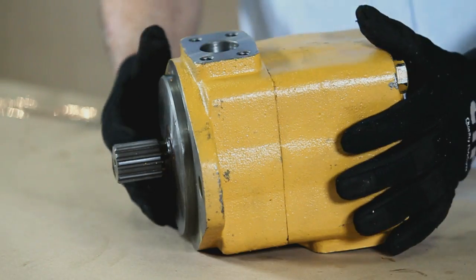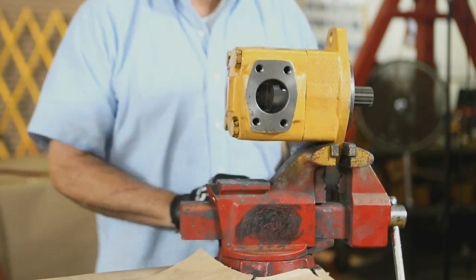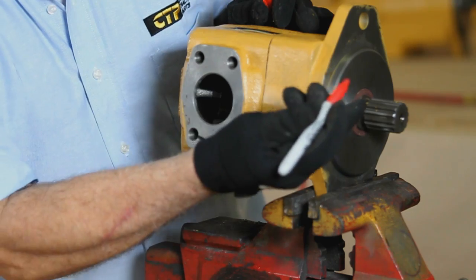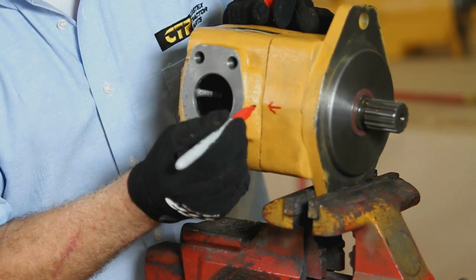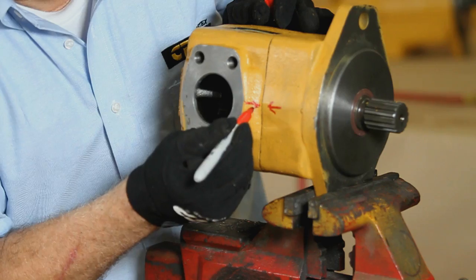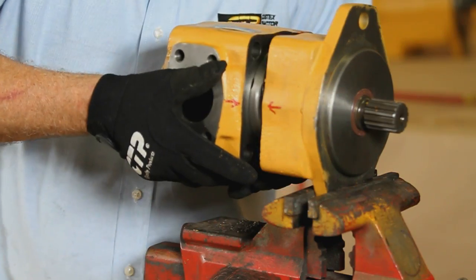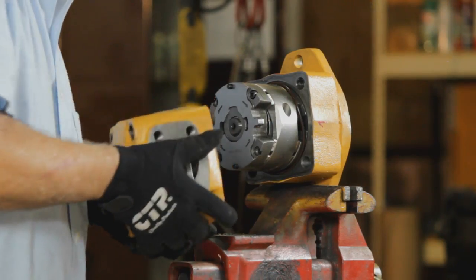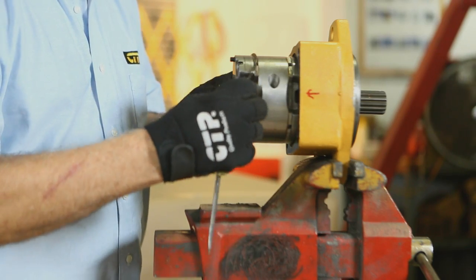Today we are going to replace the cartridge from a hydraulic vane pump. Support the pump in a vise. We make a mark between the cover and the outlet body — this will ensure the porting will be the same after installation. Remove the bolts from the inlet cover and separate the cover from the pump body. Remove the cover o-ring and pull out the cartridge kit.